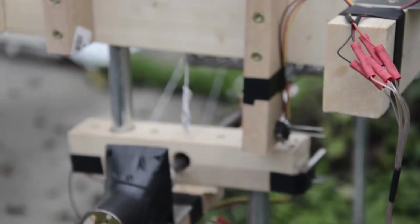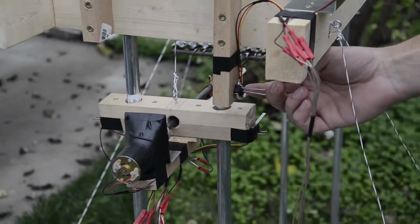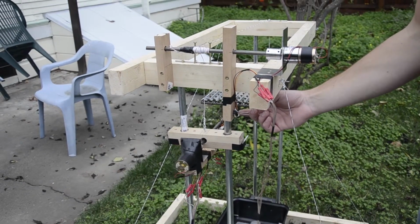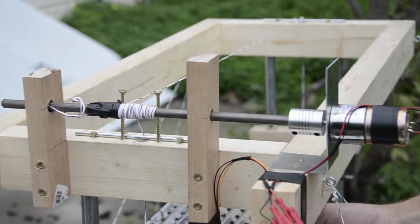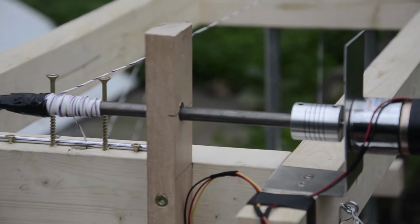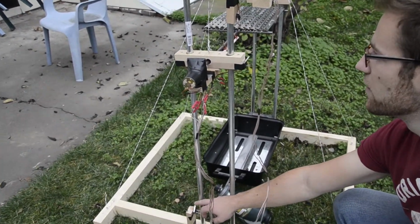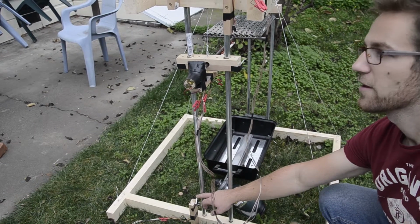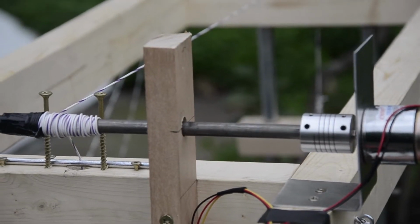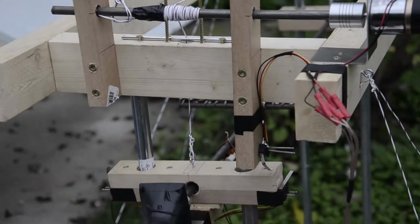You can see here how it's working if the grate is driving down. The motor is unspinning the wires and letting down the grate. The lower end stop would be reached. Stop. We can see here, as soon as the rail hits the tactile switch, it immediately stops the motor.